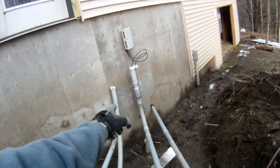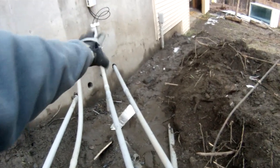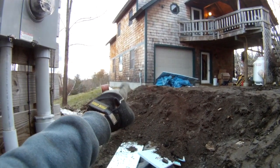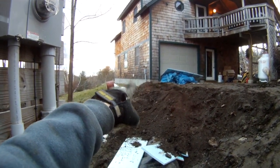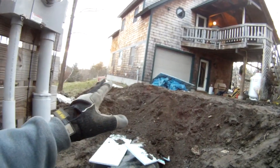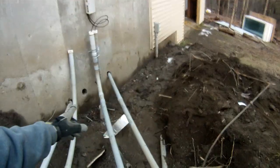there's a box which distributes telephone to wherever I want it to. What I've done is patch it into this line here. This conduit is a direct connection from the garage to the house — that LB on the side of the house, the gray one, that's where that goes. In here I have eight Cat5 cables and two fiber optic, which I can run any number of communications between the house and the garage all day long.